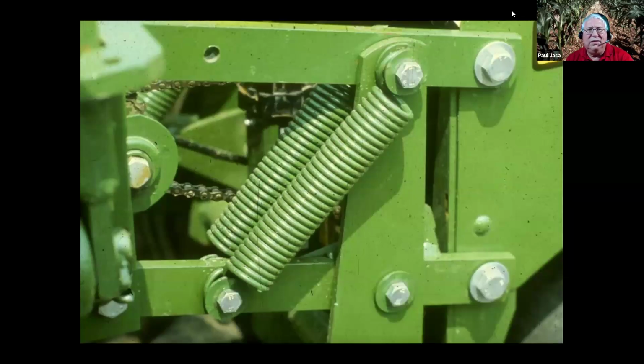So when it comes to those 4 steps, the second step, penetrate the soil to desired seeding depth, is where we really need help. If I saw a failure back there in the 80s, the planters were simply too light and the springs weren't heavy enough to transfer the weight. I showed doubled up springs here on a Deere. This package was 90 pounds each, so doubled up would be 180 pounds per row. Is that enough? It might be. Depends upon your soil conditions. And it comes down to you want enough penetration force such that the depth gauge wheels are in firm contact with the ground, truly gauging planting depth.